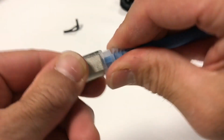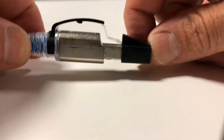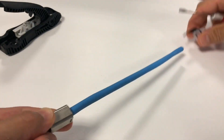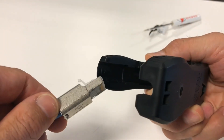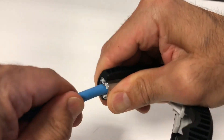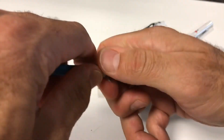The colored latch protector is simply oriented and snapped into place. The protective dust cap, part number ZP-CAP, is also available as an optional accessory and can be installed into the front of the plug while awaiting final installation. The Z-Plug is reusable up to at least three times in the event of a mis-wire. Simply remove the boot and disengage the latch by using the features on the underside of the tool handle. While pressing the latch side of the plug against the tool handle, pull on the cable and gently rock the module out. Once removed from the housing, the door can be opened using your finger or a small flat screwdriver, and the cable can easily be removed by inverting and pulling out all four pairs at once.